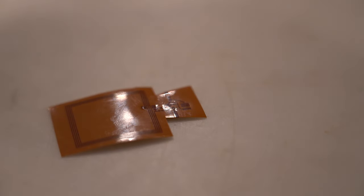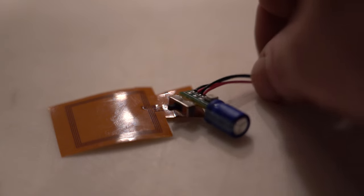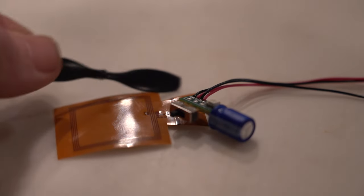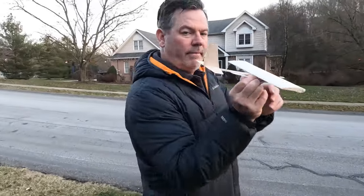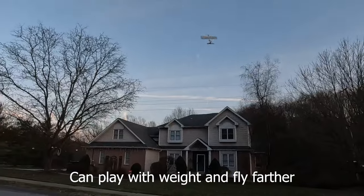Here's the NFC antenna. Instead of a light that blinks, we're going to funnel all that power to a supercapacitor — this blue little cylinder here — on a switch. When the supercapacitor gets full, the green light will light up to save it from overcharging. Then we can throw the switch, it'll turn the motor, and we can fly for a very little bit of time.